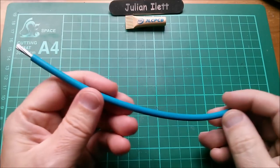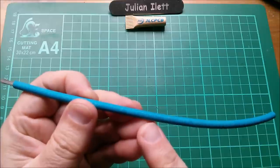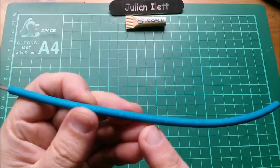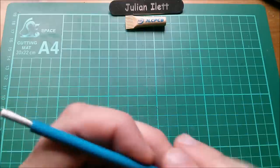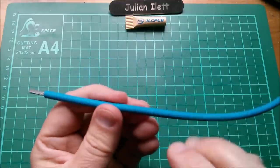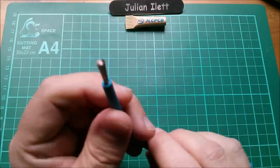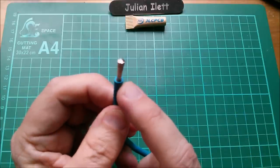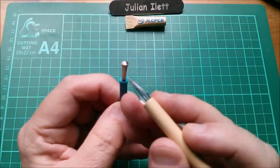Good morning. This is solar cable - PV1-F grade cable, four square millimeters, which is the cross-sectional area of the copper conductors. This one is made by Hikra Solar and it's double insulated - you can see there's a blue insulation layer on the outside.